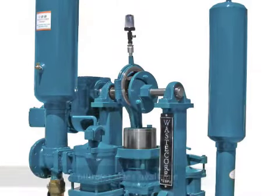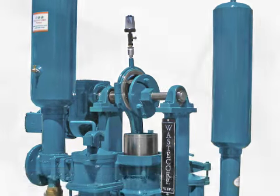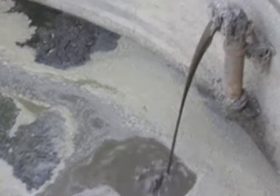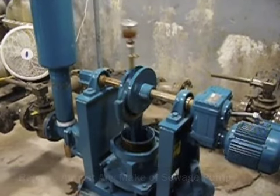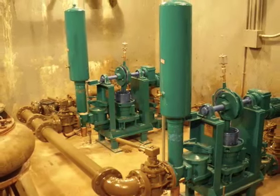This series is available with your choice of 7 inch, 9 inch, or 11 inch plunger sizes and can transfer up to 140 gallons per minute with a maximum total head of 110 feet. Space Savers do not require a concrete base and can easily replace most other sewage pump brands since the piping configurations are similar.